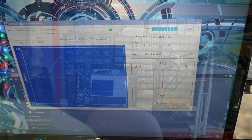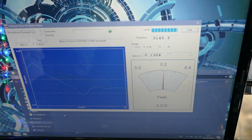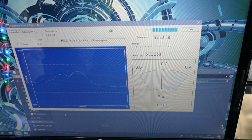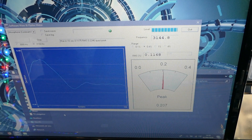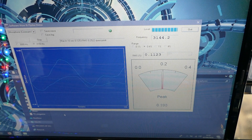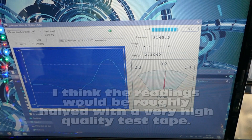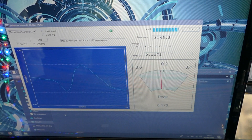I think I have pretty good results now. The machine's been left running for several hours on the new motor and belts. The frequency, which should be 3150Hz, is definitely in that order of things - it varies very slightly as you play the tape through and the start of the tape tends to be a little bit faster. The wow and flutter readings: peaking around 0.2%, with an RMS value of around 0.1% - pretty good results. When I listen to it I can't really hear any wow and flutter even on the test tape, so that's working quite well.